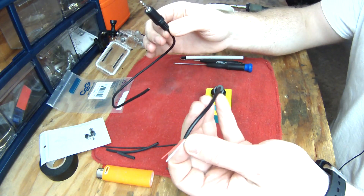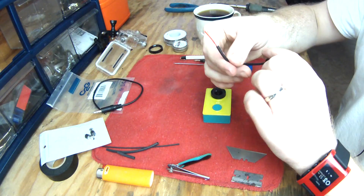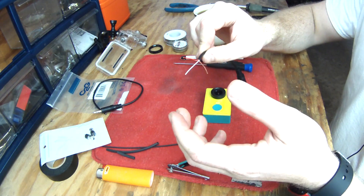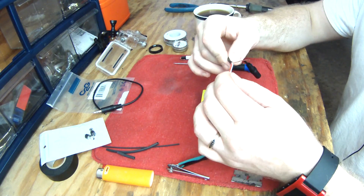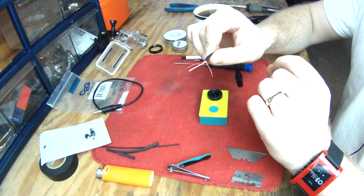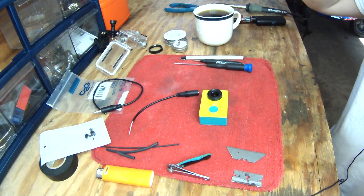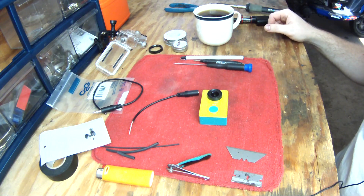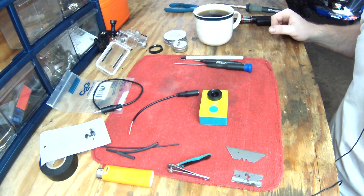Make sure you get an extension that has the correct input and output, and make sure it works before you go cutting it up. Then we're going to separate the wires — this happens to be dual mono — and we're going to wire these two together to the positive side. So we'll have the two positive wires combined, and the negative or black wire will be the shielding wire. I've tested this and done it before with this extension. It's really nice because it has non-enameled wire. Those can be really tough to solder with, so if you're not very good at soldering, I would suggest skipping it if you find one that has enameled wire.